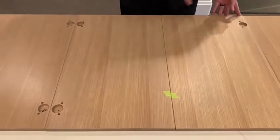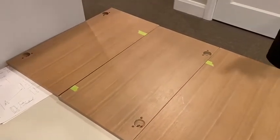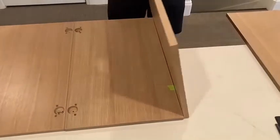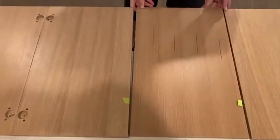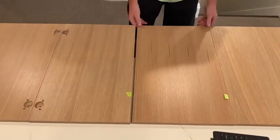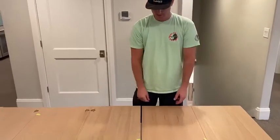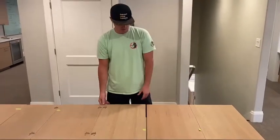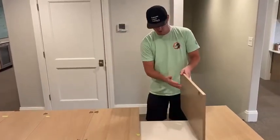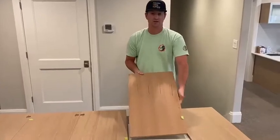These other doors — looking at them, you can see they're all backside facing up currently, and these are the better sides. As we turn each one over, the other side is not terrible per se, and this very well may have been the A side on the sheet coming in — I would have to see the whole sheet to tell you for sure. But these streaks — if that's all we have to work with, then that's what we'll use. Always look at both sides before drilling and decide, because that is definitely the more optimal side in comparison.